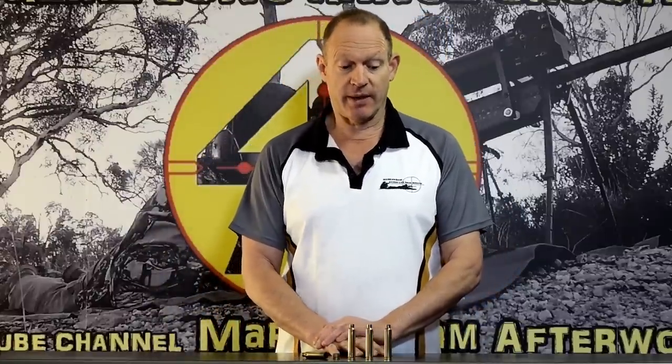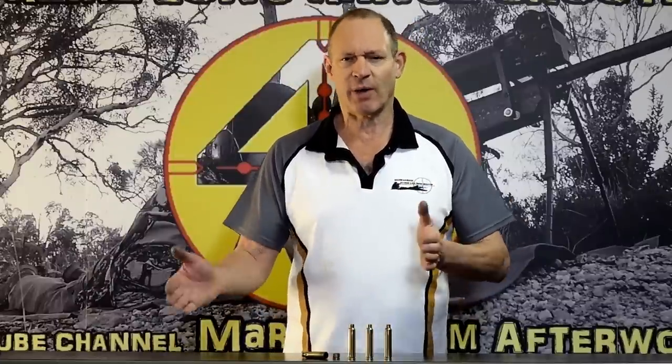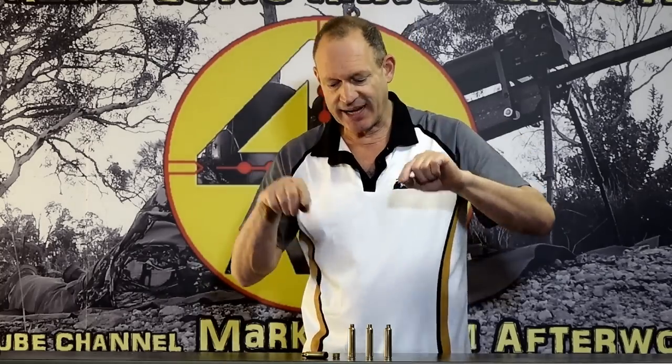Old military rifles and all sorts of weird setups can run into these problems, but they tend to be things that happen straight away as part of the initial firing or reactivation process. The more common place you'll find case head separation in a regularly used rifle with everything properly set up is in the improved case situation — when you're fire-forming a case. If you don't get that right, or even if you do, there's a lot of change in that brass and a lot of force going through immediately, which can massively shorten its life. There'll be too much growth, taking away from the weakest point between the case wall and the case head.